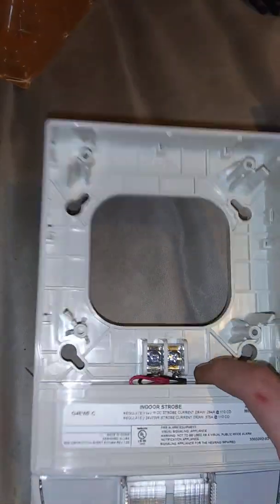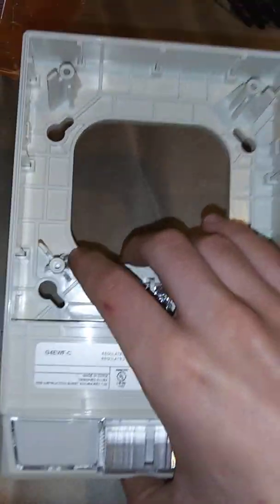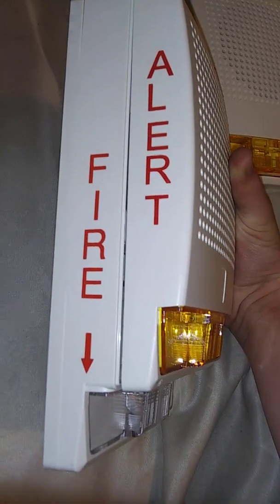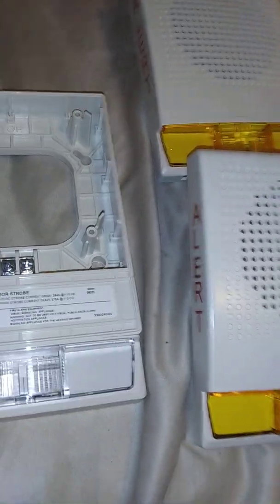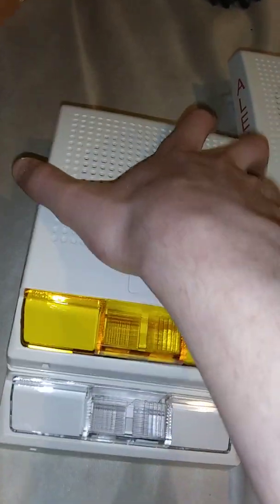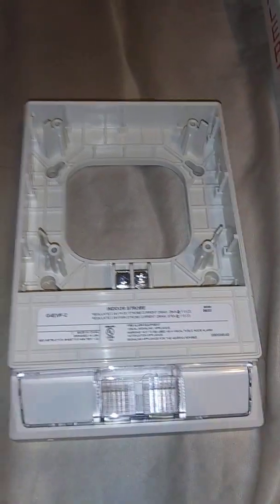So yeah, and then there's your little slots to where the speaker strobe can be screwed in after everything's wired, while this is on the back box. What a dual strobe expander plate allows you to do is have a mass notification appliance and a fire alarm appliance at the same back box, so you don't have to spend a lot more extra money on a fire alarm speaker strobe with a mass notification remote strobe on the side of it. So you could just have 2 in 1 that easily, just like that. So thank you for watching.